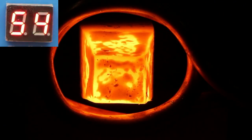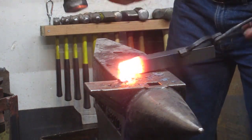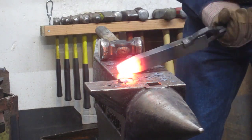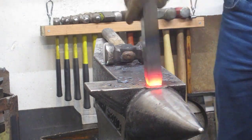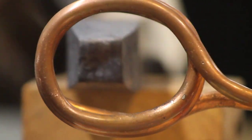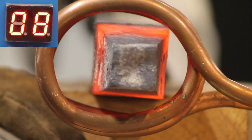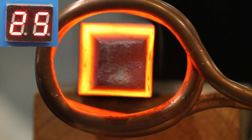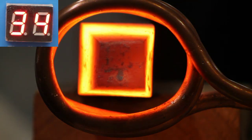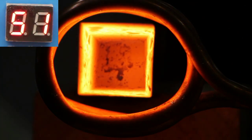At this point there's enough heat penetrating all the way into the metal, and the bar itself is warming up, so I'm getting pretty good heats - it's no longer so frustrating with the bouncing. One more pass and we'll be able to move on to the fuller ring. One thing about my other camera watching the anvil: its infrared filter is not terribly good, and those just look hotter than they are. When I'm putting this back into the coil, it's not as hot as it's looking on the camera.